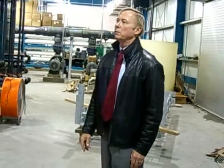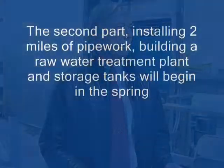It is 1,000 gallons a minute for the Palmer River. 1,000 gallons a minute for the Vinicum wellfield. Then it is about 1,500 gallons a minute for the Palmer River. Because what's going to happen here is we are going to pump 4 million gallons a day from the Palmer River. And at lowest recovery, that's about 30%, we'll be picking up 1.2 million gallons per day.